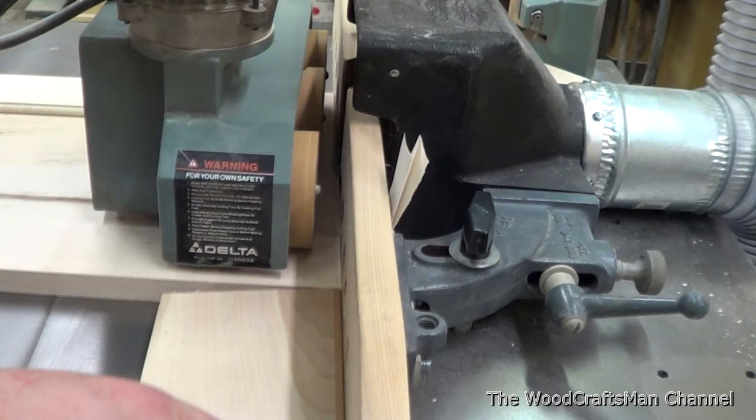The reason I'm concerned about the end grain tearing out is I build my doors 1/8 inch oversize, meaning I have the shaper set up much like a jointer where the infeed fence is offset 1/16 of an inch. What this does is true up the edges, remove all the saw kerfs, and at the same time profile the entire edge.